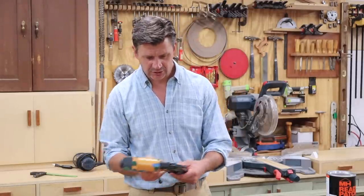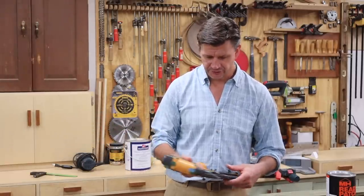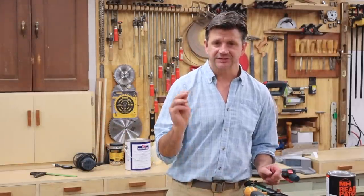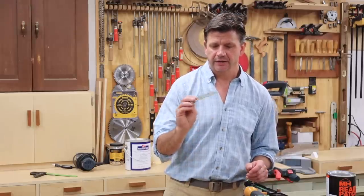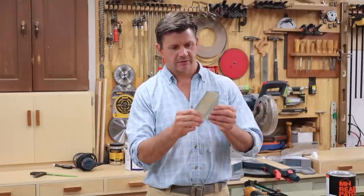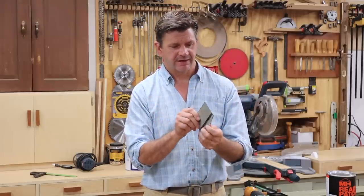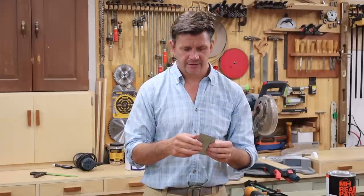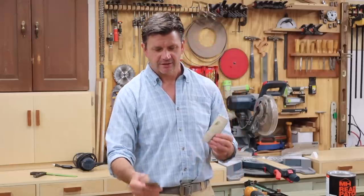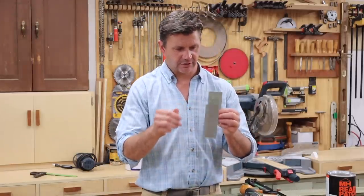And I'm not, because whenever I do any exterior work and I'm using my nail gun, I use stainless steel nails. So you can tell that they're stainless steel by using a magnet. You can see these are regular nails and the nails stick to each other because stainless steel isn't magnetic and regular nails are. So here's the stainless steel nails and you can see they don't stick.